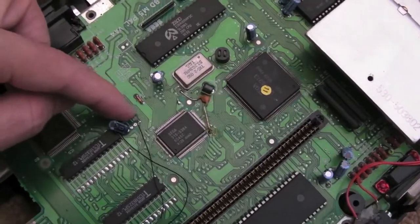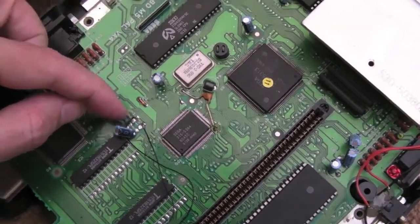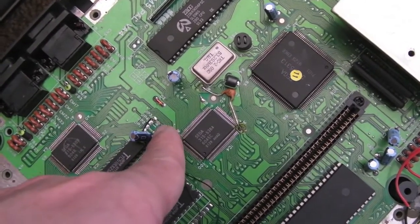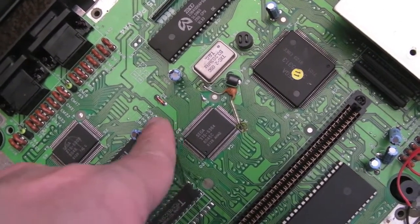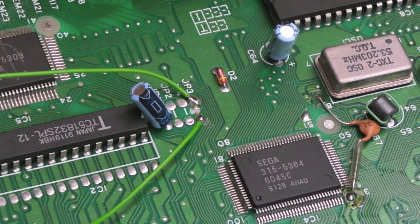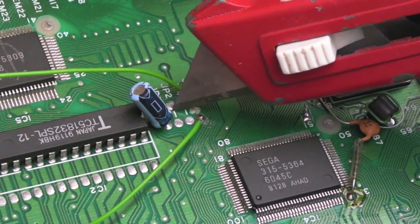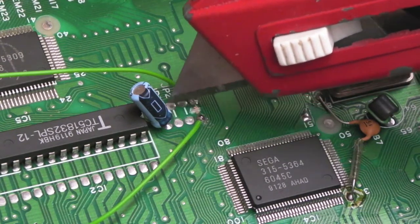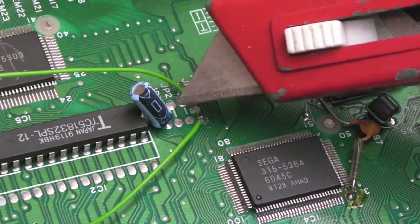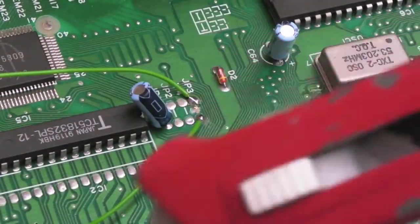I'll get that out of the way and join the pin back to the board, solder it back on again. You can see the jumpers here - not the cleanest work; I did this in a bit of a rush, so I'll tidy this up as well. I just need to work out what the other jumper is - I suspect it's JP2. I'll need to cut the track a bit like it was done there and then have a switch go into that.